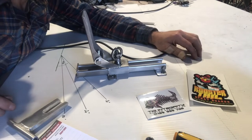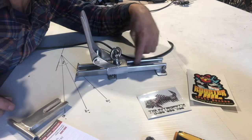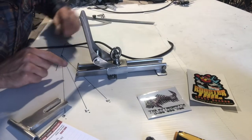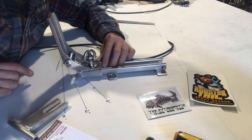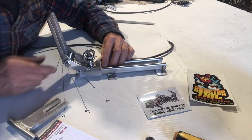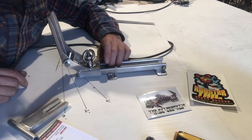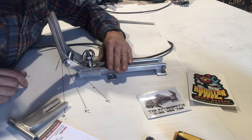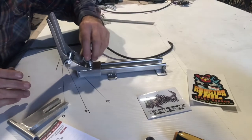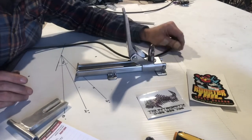Just to show how it works — fix it down however you like, either through the tags or through the center. I can drill some holes in there. Fix it down, set up the bottom of the transducer according to where Hummingbird want their transducer set — there's plenty of videos on that. You can set it a little bit more down so it goes a little bit deeper in the water, because this mount will allow that to happen. Set it up, screw it down, it's all tight.